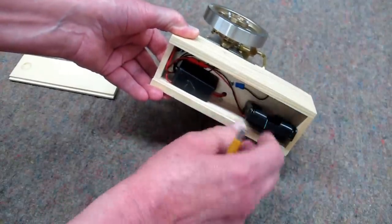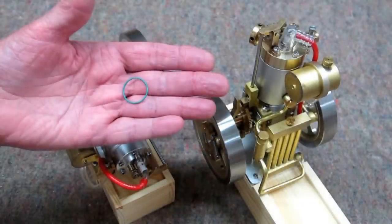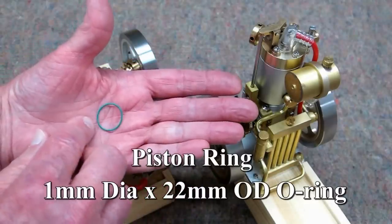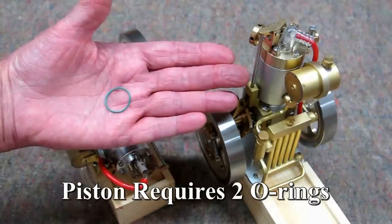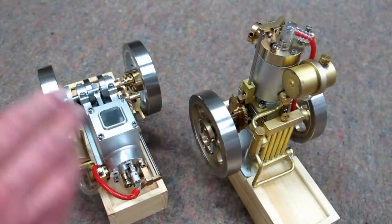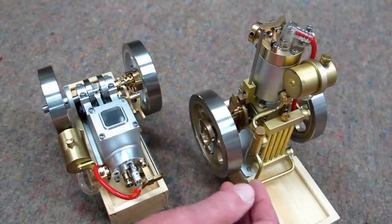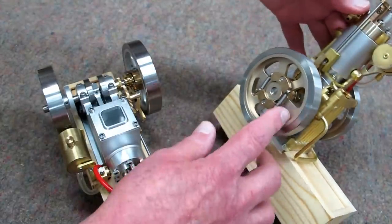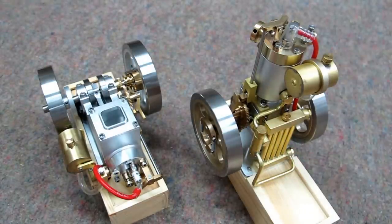There's a little battery pack for double-A batteries — this is your ignition system for the spark plug. I asked Banggood to clarify their listing of the O-rings. The correct O-ring is 1mm diameter cross-section by 22mm outside diameter, sold in a package of four. The correct listing will be in the description. The machining on these engines is very nice — no scratches or dings, carefully assembled. The quality of the machining, bead blasting, anodizing, and brazing all have a very nice appearance. These are very high quality model engines; I would not want to make either one for the price they're selling for.